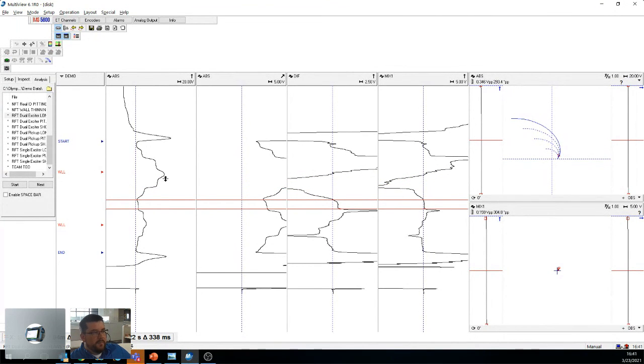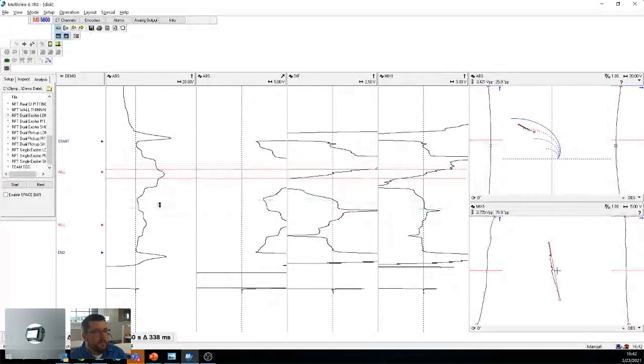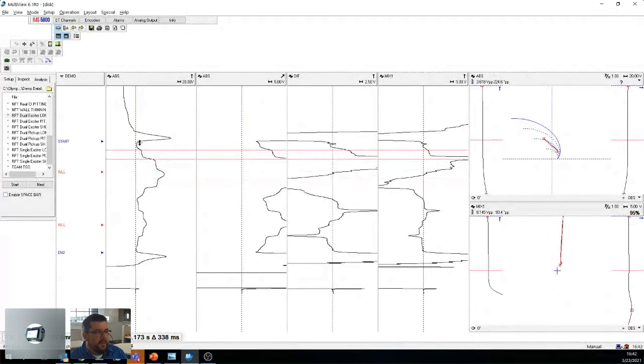So we kind of get what I call the toupee, right? The extra bump here, because the entire defect is so long that the entire probe fits inside it. So you see the wall loss not once, not twice, but three times, which is why you get this little extra bump up here. But technically your defect is only this deep, which is still pretty deep, right?